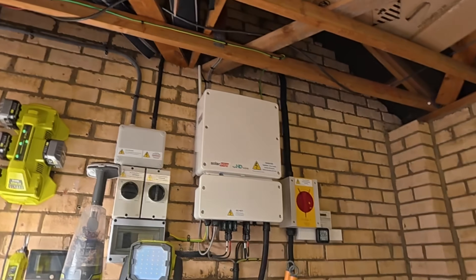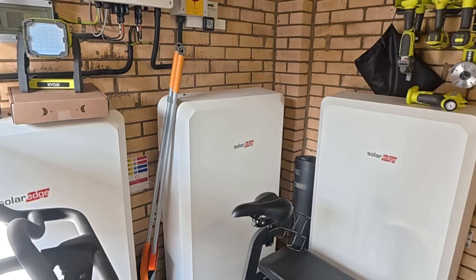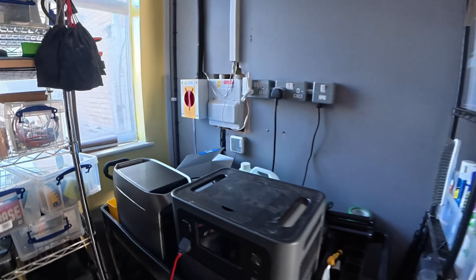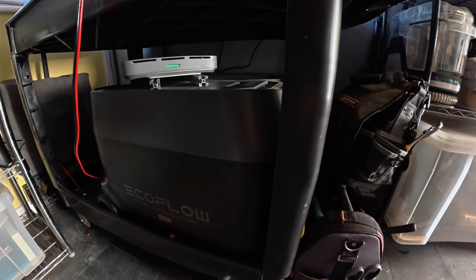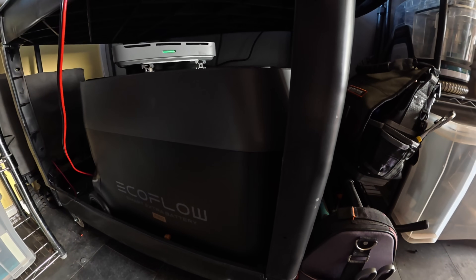Now let's head into the garage - I'll apologize for the mess, we're doing a bit of work in the house. I don't know why I call it a garage; there hasn't been a car parked in here for 20 years and we don't even have a garage door anymore. What you can see here is our 10kW SolarEdge inverter connected to 29 kilowatts of batteries - this is our main system and provides about 90% of all the energy we generate. And here under the bench is our EcoFlow PowerStream: an 800-watt micro inverter connected to a Delta Pro and a Delta Pro extension battery. So this is our third system.